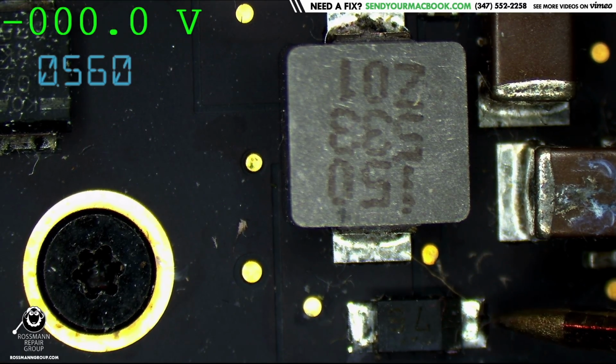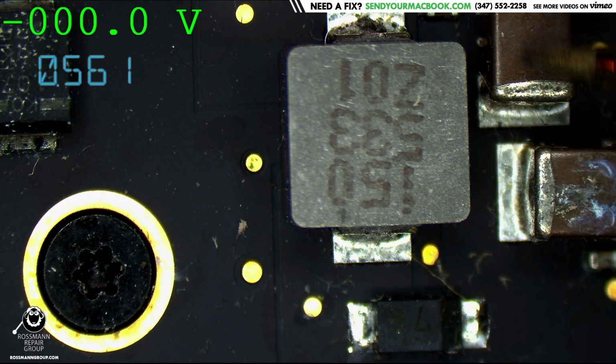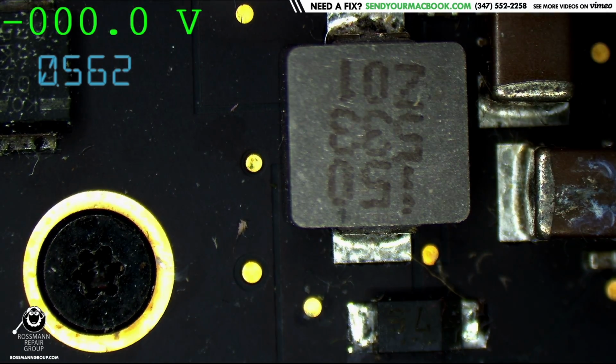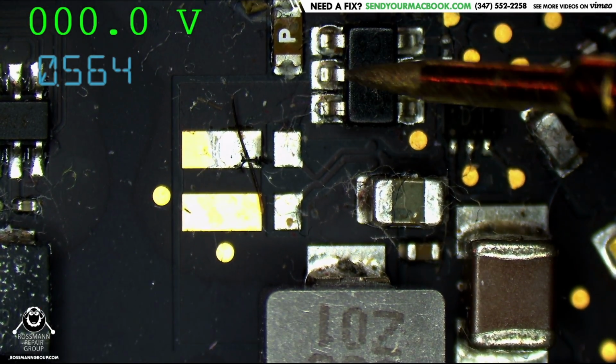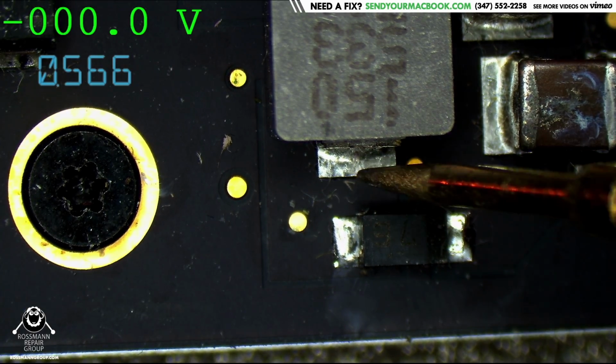That then goes through the diode. And this way, once those large spikes are saved by these capacitors over here, they're unable to go backwards through the circuit and send 27 volts to an area that's supposed to only be 8 volts, because this fuse is providing 8 volts to this area, not 27. It's going to become 27 at this point over here.